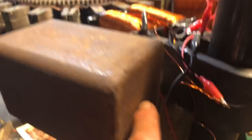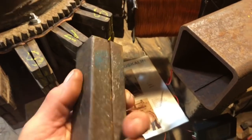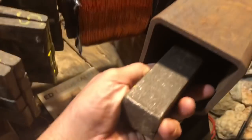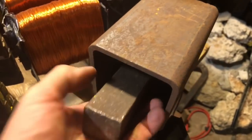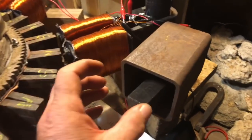What I'm going to do here is drill a hole in this — it's an inch and a half square stock — and I'm going to bolt this together inside. I'll put it like in the center, and what I'm going to do is build an aluminum spool that goes in there.